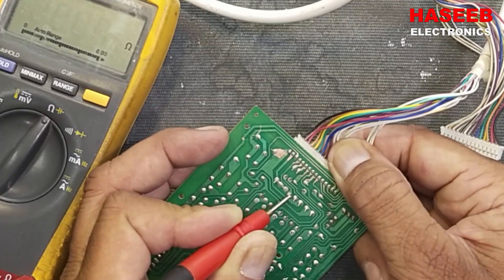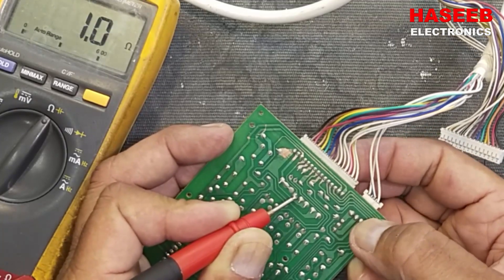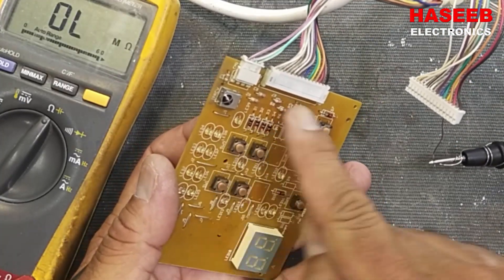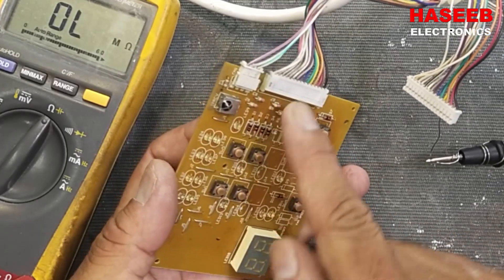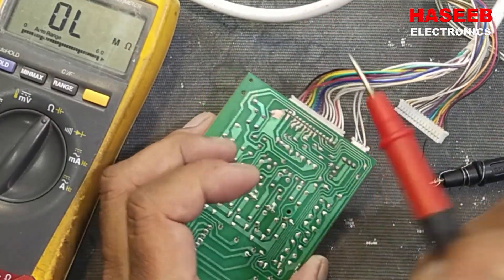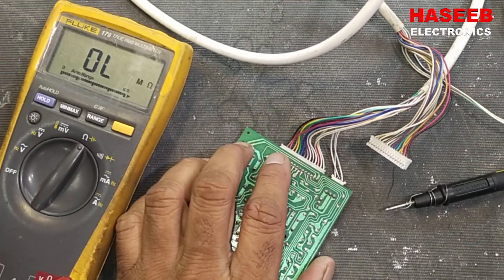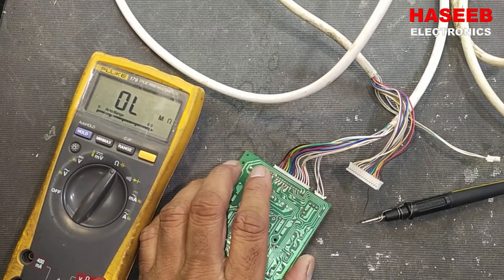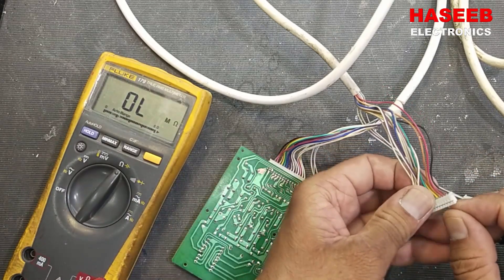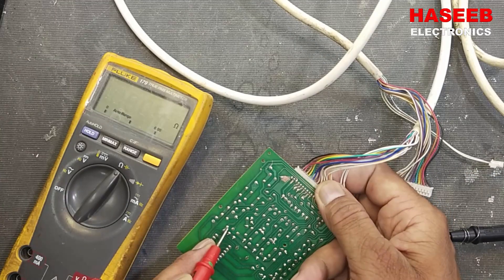Because it is a control panel it is always used to set the number and digit settings. When pressed, it disconnects from the circuit — so that is why it was dead. Now we have to desolder and resolder it again, and then we will check the same resistance on these pins.